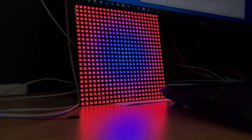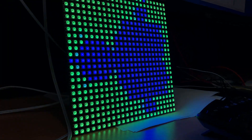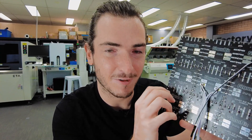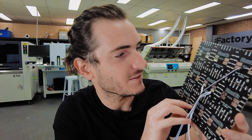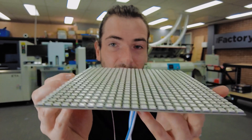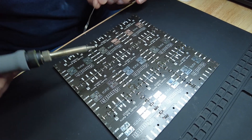We also ran a few boards through the pick and place machine and made this 3x3 tile — and it's got some weight to it. We put this together to test the tiling philosophy: whether the gaps were appropriate and whether the solder pads were about the right size. It was a resounding success. We were able to power this entire 3x3 matrix using just the two pads in the center, distributing power out through all the edge connectors. With no wiring whatsoever, we routed the signal path snaking down through each tile in a serpentine path by soldering each D-out to D-in. Aligning on the bench face-down on a silicone mat without any special tools, everything lined up very nicely.